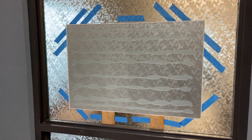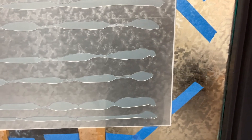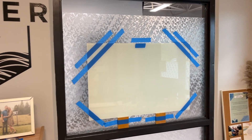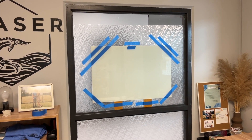Let's go see what it looks like from the backside. Okay, so it does show up. I would have had to have taken a trowel and troweled out a full smooth layer over the whole thing for it to not show up. Hey, you can always hang a poster on this side or put a matching whiteboard on this side. It's all about what it looks like in here, and in here it'll look really good. You can worry about the backside at some other point in time if it matters. But for now, that is how you put up a mirror or a whiteboard using silicone. Thank you so much for watching.